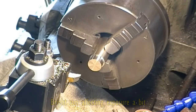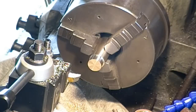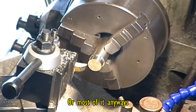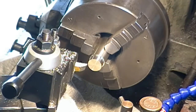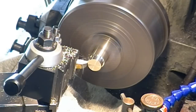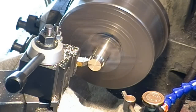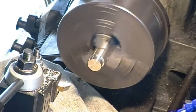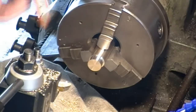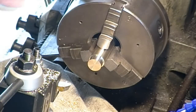I cut the spare off the previous piece with the bandsaw and faced up there, just turning down the last little bit. I've got a five thou cut to go to balance the other end, and the other end we've got to face off again to get rid of the center drill hole, and then we'll go from there and break edges. This is 800 now, same as the other end nominally - just put another tool in and get these edges dealt with, turn it around, do the other end.